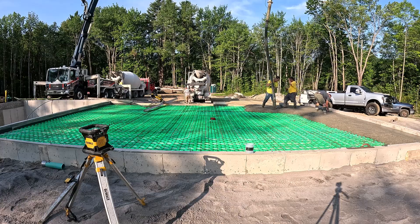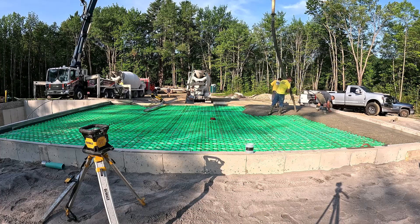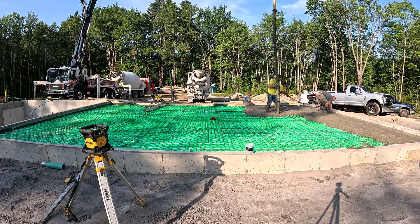The reason we're using a pump truck on this is because we just got done pouring the basement floor — that was 48 by 24, four inches thick. In part one I show you how we pour a basement floor down inside nine-foot walls using a power screed, and we're going to use a power screed on this garage too.